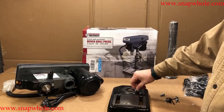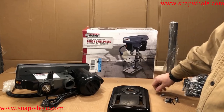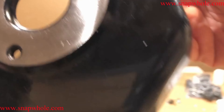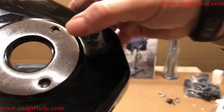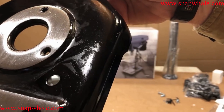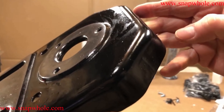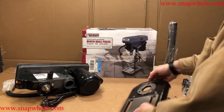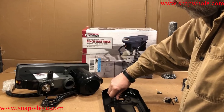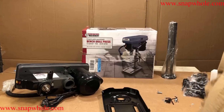I'm afraid of cross-threading them. These two I can thread the bolt in, but this one I can't. Let's go look and see how much debris is in there. This is the hole that has the problem — it doesn't really look like any debris in there. Sometimes you can turn it over and go from the bottom; maybe it's clear enough to thread. And it is, so I'll have to drive that in with a crescent wrench.